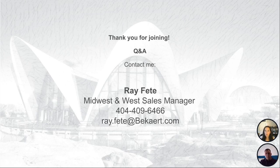All right. What is the average dosage needed per cubic meter or cubic yard? That's a nearly impossible question to answer, but I'll talk my way through it. There are so many different applications for the fiber, so it really depends on what you plan on using it for. If you're using a structural application as opposed to just trying to replace welded wire mesh, you could be anywhere from 13.2 pounds per cubic yard up to maybe 50 or 60 pounds per cubic yard. Generally speaking, on everything I've done, I'm usually somewhere between 20 and 40 pounds per cubic yard. But once again, you could be on either side of those really easily.